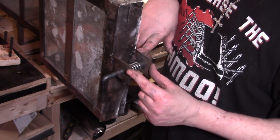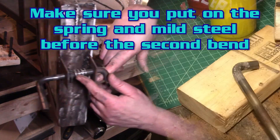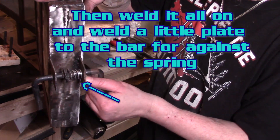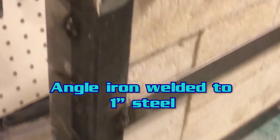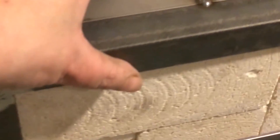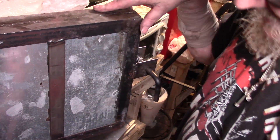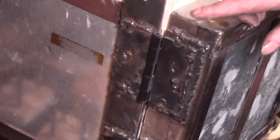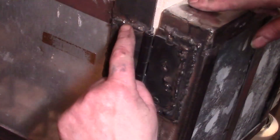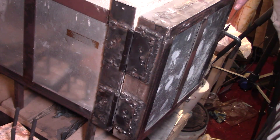Here's the other thing I'll show you — so this handle is just two pieces of mild steel, a piece of half-inch steel. I took the torch, bent it, put a spring in the middle so when you pull it like this, see how it puts pressure against it to lock it in. It's about one-inch steel — all the same steel here, doubled up and welded together. The hinges were probably the worst part — look how bad these are, those big nasty welds. That ain't coming off, but if I want a new door I'm gonna have to cut this whole piece off and build a new door or grind it all down.